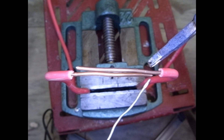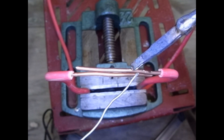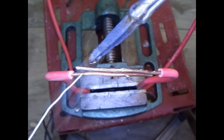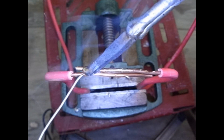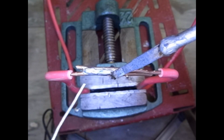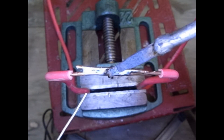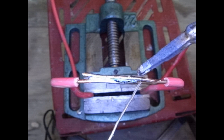Let's see what happens when we try to go too fast, which is the same as operating too cold. Try to run along here — see it? It doesn't want to stick. Being impatient, trying to go too fast, it just doesn't stick. Now, if I do it right, I get in here and wet my tip, get the heat flow going, and then I move along here at a good rate. I've got to get both sides of the work going.